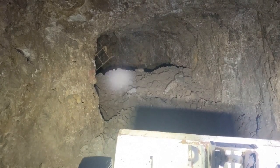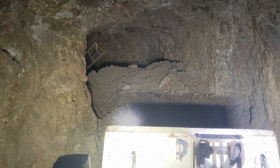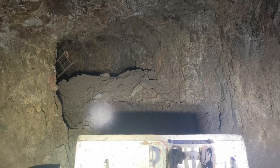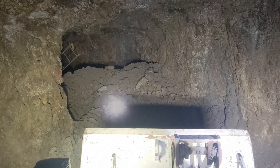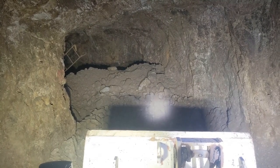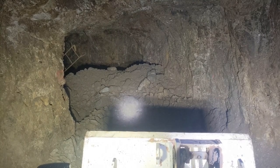So now what I've got to try to do is take all this muck sitting here in the magazine drift and take it all the way to the back, or as far to the face of the drift as we can. Because the face of the drift is in waste — we mined through all the way to the end of this pipe, sampled it, and it doesn't run. The ore we want is what's up here — that stuff runs in pockets, so we're going to be trying to stope that out soonish. For the time being I'm going to be trying to take all of this waste here, push it all the way back to the face, and give us an underground parking area for the LHD, the truck, and the side-by-side for the coldest part of the year that's coming up, just so we're not having to abuse everything — drain batteries, cold start, hit glow plugs for five minutes just to try to get our stuff to start. It stays about 60 to 80 degrees year-round in this drift, and that'll work just fine.